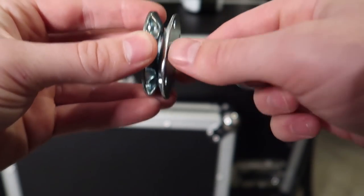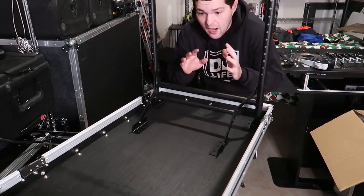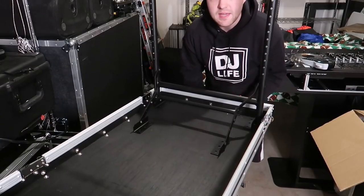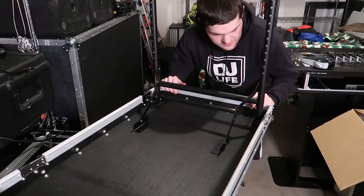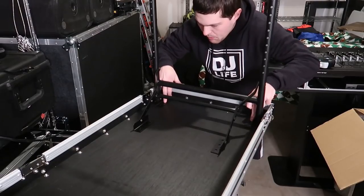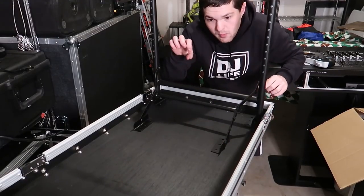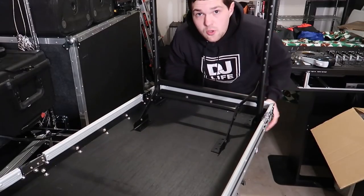The first step here is literally just eyeing up how we're going to put the legs on. I'm lining the legs up and then we'll be drilling holes and riveting these from the other side — from the top side — into place with rivets and some washers. I'm going to measure these out to make sure I have the right distance, then rivet this part in, worry about the support right here, extend the legs to the height we need, make sure they're level, and mount our catch pins that will catch on the rack. Let's get working on this — enjoy the time-lapse footage.